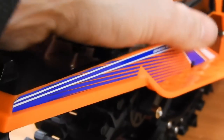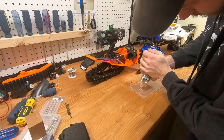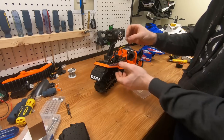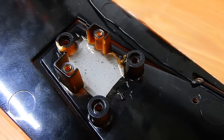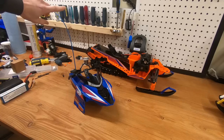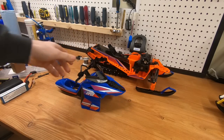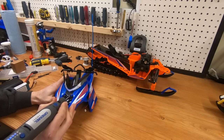I put tape inside to cover the holes we drilled earlier, but it's not permanent because the track would rip it off. What you need to do is put the tape underneath so it makes a little bowl, pour epoxy in, and once the epoxy dries you can just take the tape off — probably the easiest way to do it. I decided to go old school with this machine and use an FM radio, so it has a long antenna on the back. That's what I had on hand, so that's why I used it.